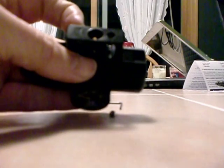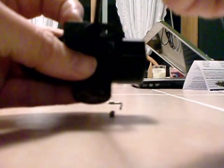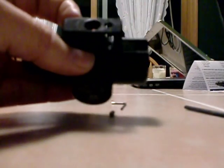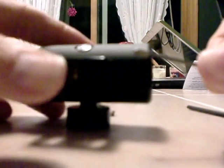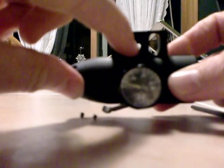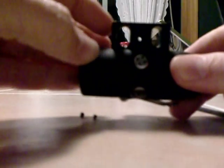Slide that in, and then screw this all the way down as far as possible until it locks. And then in order to provide an extra bit of stability, there's also the larger of the set screws, which uses a 1/16 inch hex key. That goes in the other hole and screws all the way down until it locks into position so the adapter won't slide off anymore. The other two set screws go through these side holes once you're screwed in to the air transfer tube.